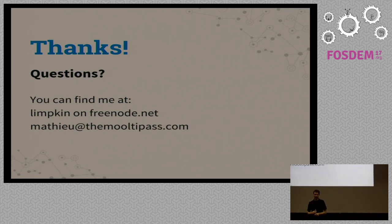Okay, yeah, this I didn't talk about. So getting CE and FCC certification, contrary to most Kickstarter campaigns out there, we have done it before the Kickstarter. Once we were sure that the hardware was final, I went to a couple of certification centers in Shenzhen directly. You think that Chinese certification centers are not reliable, and actually they're not joking at all. So basically you send all your schematics, layouts, a quick description of the project, a quick getting started guide, so the certification center can make sure that the device is working and will characterize the RF emissions.